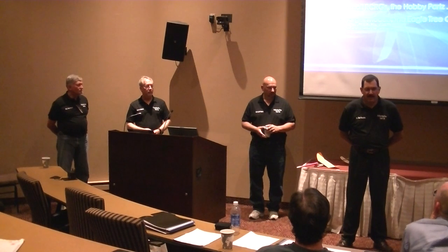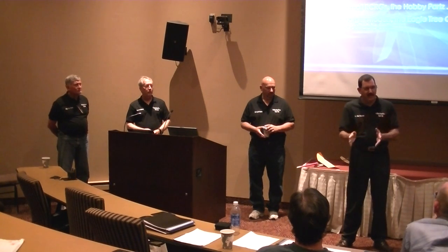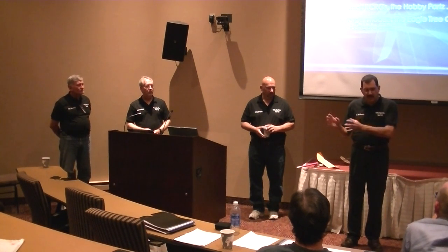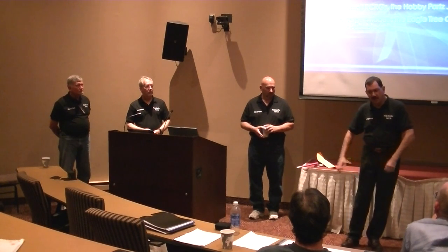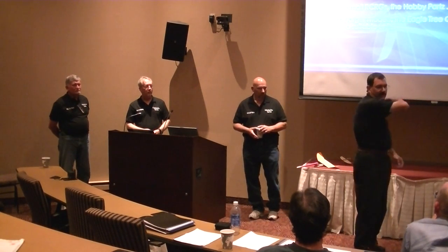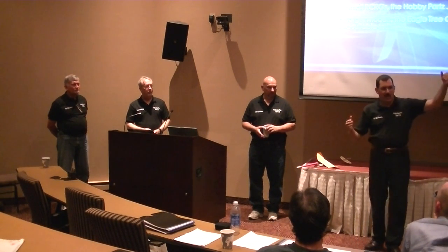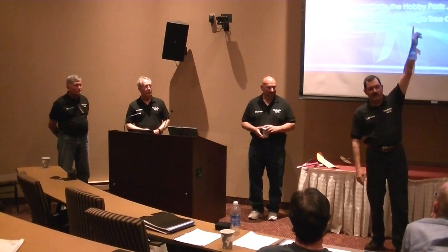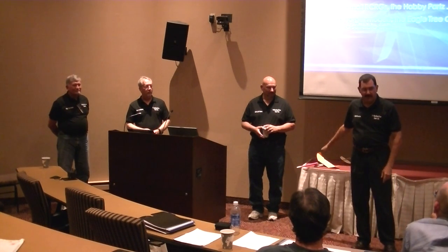Like I said in the report, I kind of assimilated these higher performance models to the SA models. And then I also saw that they were using these single-axis gyros on rudder control of the discus launch, because on a discus launch, you're throwing this thing around in a circle like this, and it comes off your hand and tends to wiggle like this. Well, that's a lot of energy lost. So they put the gyro on to help stabilize that wiggle, and then it ends up going up more straight. So I said, hey, if it works for that, it can work for this.